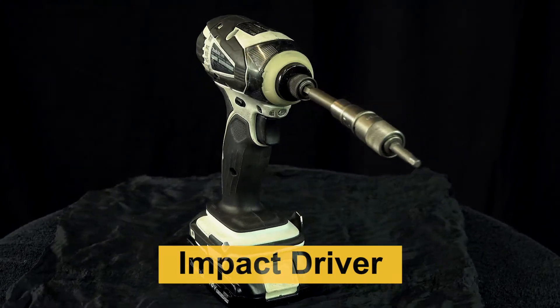Another tool commonly used in the industry is an impact driver. They're lightweight, but you really don't know what torque you're delivering with these. To use this tool, you're fastening and looking for depth as well as trying to figure out when that screw is truly tight — they're a little tougher to figure out. Finally, the easiest one is the Panasonic tool. You can set it with a number setting, tighten down the fastener, hold the trigger until it shuts off, and you know you've achieved the proper torque.